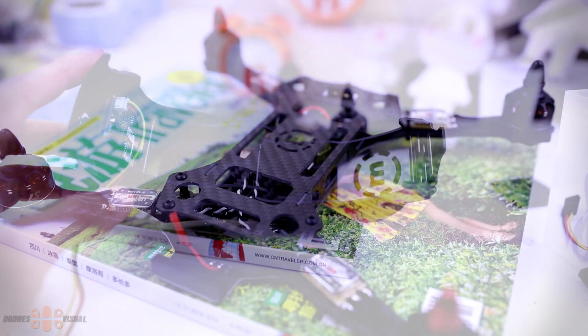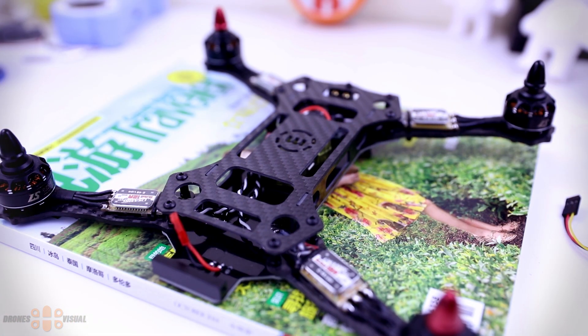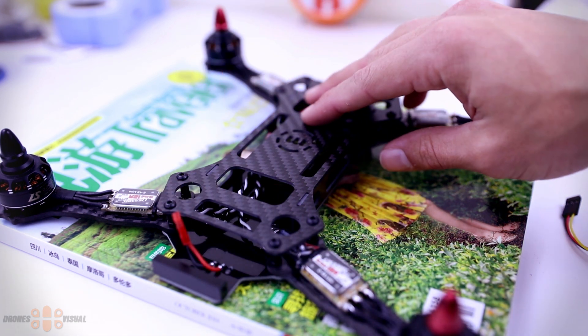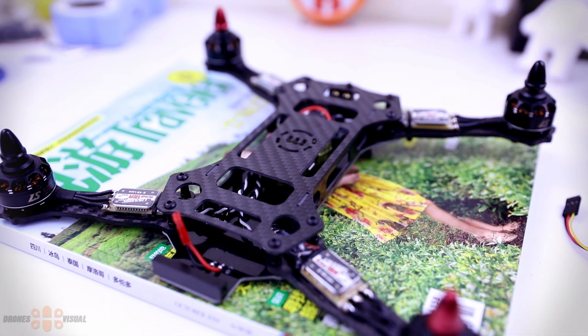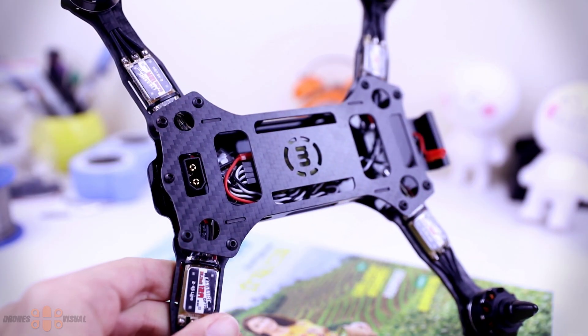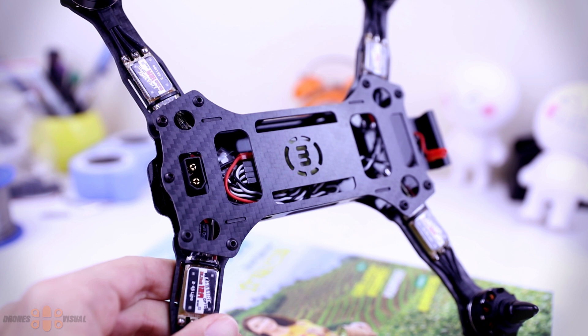Now let's take a look at the lower part of the frame, which contains the circuit board, the CC3D Atom Mini flight controller, the ESCs, and the motors. There is a separate JST connector to power your FPV system, and on the other side a connector to power the quad directly from a LiPo of up to 4 cells. The components are arranged with care and everything looks tidy. There is also an aperture on the side of the frame allowing access to the USB port of the CC3D flight controller without needing to remove the upper plate.